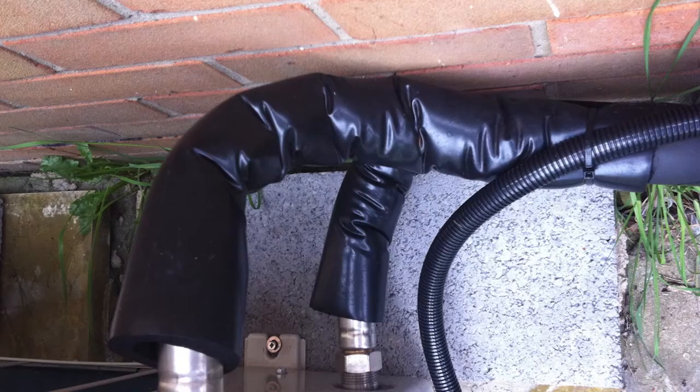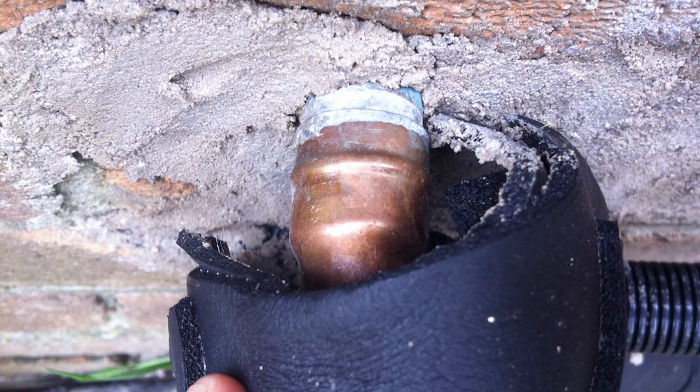We've seen pictures of installations where bits of the pipe work coming out of the heat pump are exposed and not properly insulated — all you're doing is heating the air around it. Heat pumps are a very clever, very energy-efficient piece of kit, but where pipe work isn't insulated properly or there are small areas mis-insulated, the costs add up. An un-insulated heat pump could potentially cost the householder between £100 to £150 extra on their fuel bill per year. Adequately insulating gradually saves the running costs.